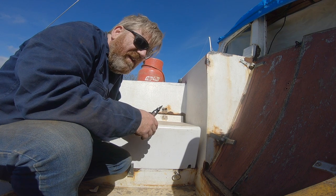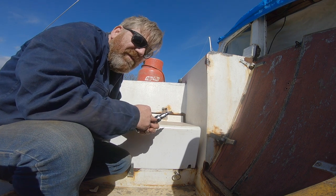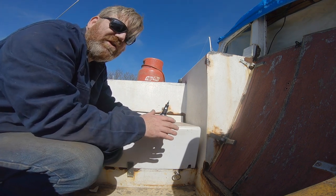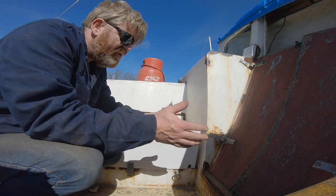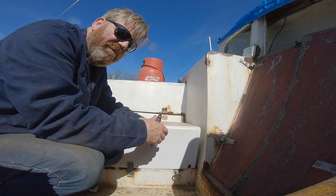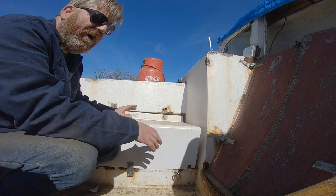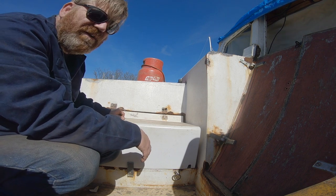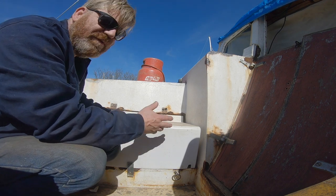But I can't see any good reason, any need to have that opening hatch in the back, and I'm starting to wonder whether there might be more benefit to us as liveaboards to have a cockpit with no opening hatches at all, that's just completely, totally watertight, so that you can fill the cockpit with water, it'll drain out the back, and there's nowhere for it to get into the boat. Still undecided on that, but I'm leaning more towards that at the moment. Because every time you put a lid like this in, however you do it, you've got hinges and you've got openings, and that's A, somewhere for corrosion to occur, and B, somewhere for water to get in. So, I don't know. Let us know in the comments what you think. I'm leaning more towards no lazaret lids at all in the cockpit, but we'll see.